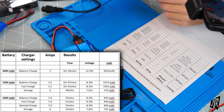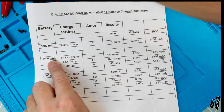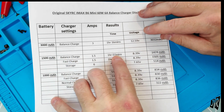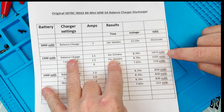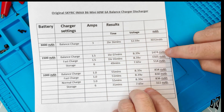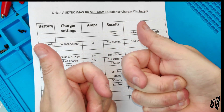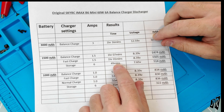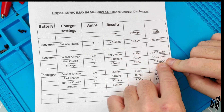I've had batteries coming out the wazoo, but the figures are very consistent. For the 1500mAh battery — used in the 144 001, A959, and 979 — balanced charge took 1 hour 7 minutes, and fast charge took 1 hour 1 minute, saving about 6 minutes. Interestingly, balanced charge returned 1474mAh, just under the rated capacity, while fast charge pushed up to 1501mAh — probably because balanced charge is balancing both cells and one cell isn't doing well, while fast charge just pushes in as much as it can. Storage took 49 minutes from full down to 7.65V at 514mAh stored capacity.